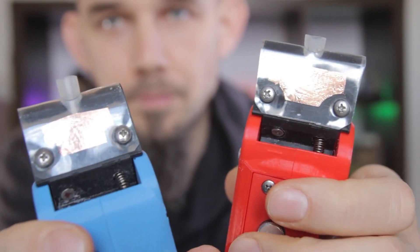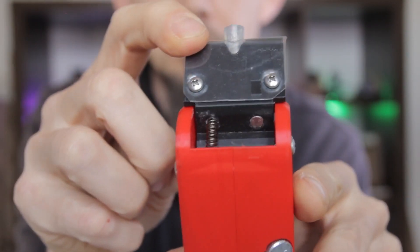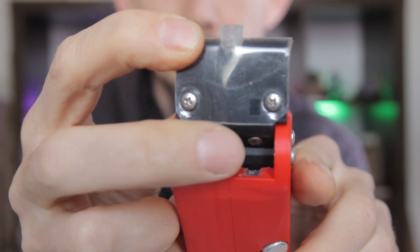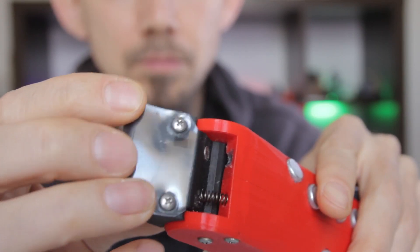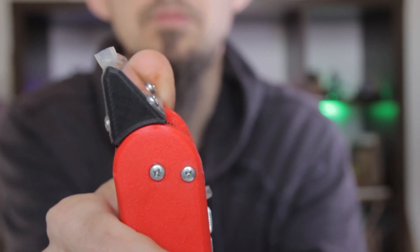The design for the Ohms' bendy pitch bend mouthpiece is exactly the same on both of these, with a pair of hall effect sensors and magnets measuring the position of the mouthpiece itself. The mouthpiece has two tiny bearings in here for smooth movement and it's spring-loaded so it's self-centering.